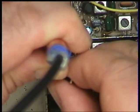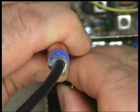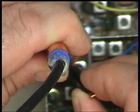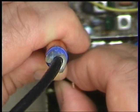If you don't peak these coils, you're never going to get full power out of these radios. And you can be hard pushed to get more than 2.5 watts anyway.